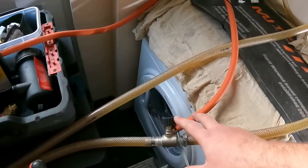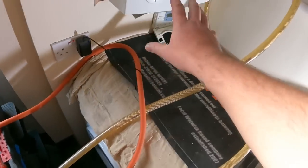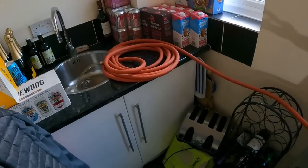system cleaner. So we're going to dump some water out the system now with the hose here. So if I open that up, turn the system off, open that up, we've got the water draining out there. And what I'm going to do while this is happening is just turn the water off to the header tank, so it drops the water out the header tank while we're up there, cut in a 15mm lever valve, ready for tomorrow for the thorough flush. So we'll go up, get that header tank cleaned out, flushed out. I've got the Hoover up there, got the wet vac up there, and some rags. So we'll get it all cleaned out, and then it's perfectly clean, ready for tomorrow.